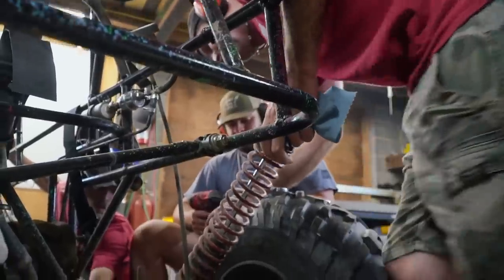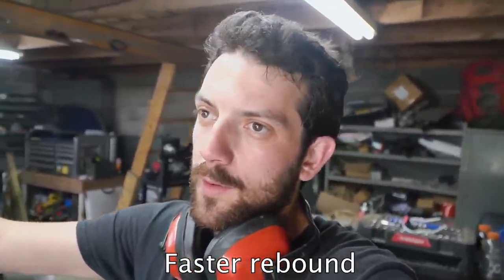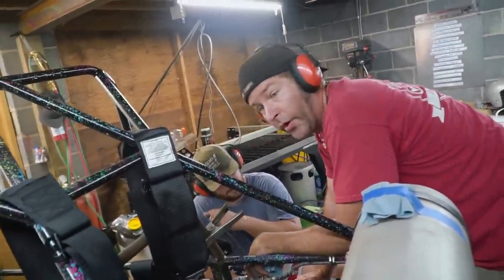Just to explain ourselves - these are the exact same make and model shock as what came off, they're just specially tuned with performance parts. Basically, Ike drained some of the oil out of the shock to knock down the rebound - basically make less rebound - which should give us a nice jump rather than the end-over-end jump. I'm hoping that'll fix it, because it's either these shocks or we're spending two or three thousand dollars on shocks - more than we have in the rest of the project. Shocks are crazy expensive.